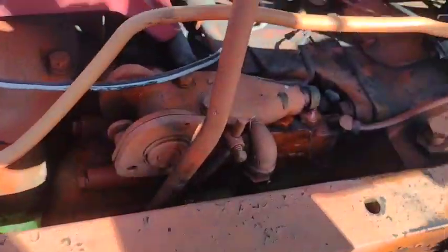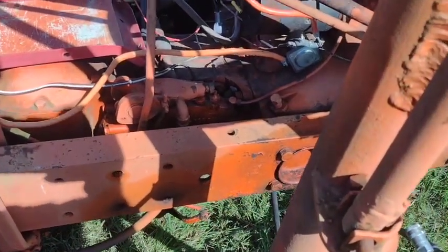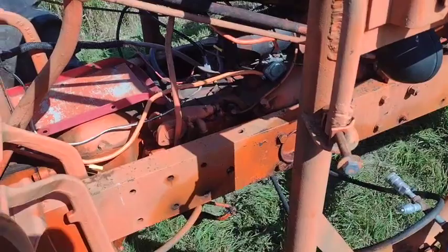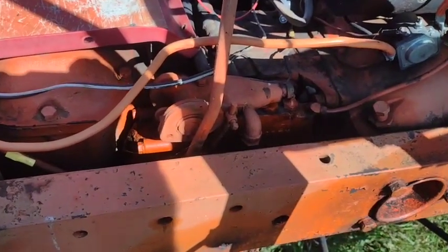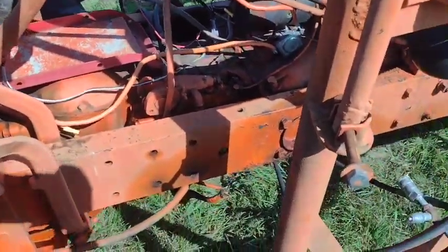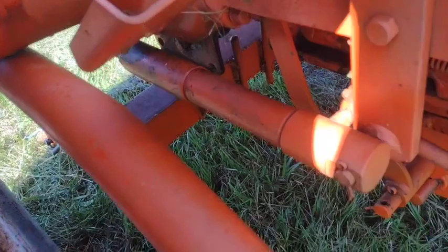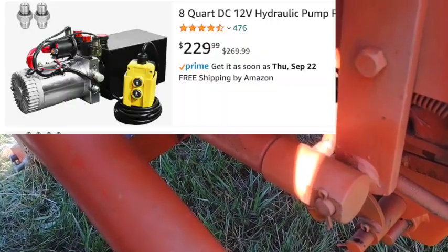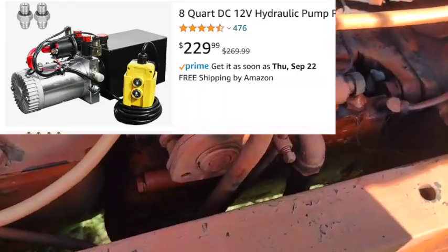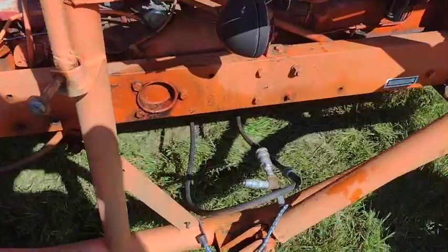The next big issue is the hydraulic pump. This is a weird piston pump design and parts are basically unobtainium. If it doesn't work, what I was thinking about doing with mine is just deleting the entire factory hydraulic setup and cobbling on one of those 12-volt electric systems, because basically all the hydraulics that little pump can run anyway are these two measly hydraulic cylinders here for the rear hitch. You could very easily run it off one of those 12-volt pumps people use on dump trailers.